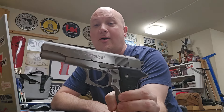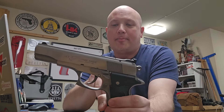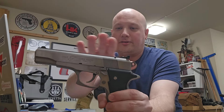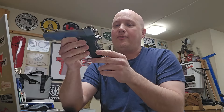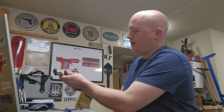It's a double action, single action. I have reviewed a double-action-only 1911, but because this is DA/SA, this receiver is completely different than most 1911s. It looks like a 1911 up top but functions very differently. It doesn't have a grip safety or a manual safety. It does have a decocker, kind of like a SIG — I can cock the hammer and decock it, just like a SIG P-Series pistol.